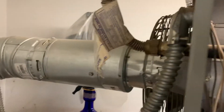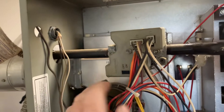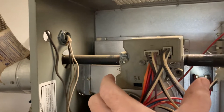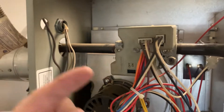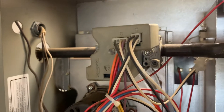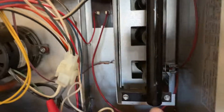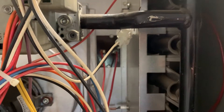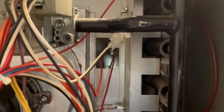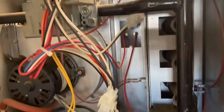The first thing you have is the gas coming in. You'll have a gas line with a shutoff valve coming into the unit, going through some black pipe and then into this gadget called the gas valve. This one is inside the unit — it may be outside as well — but wherever it is, it's in line with your gas because it's the valve that controls the metering of the gas. When the valve opens, it feeds the burners. There happen to be four burners on this unit. The gas flows out and is drawn into the tubes inside the ductwork, where air is forced over it and the hot air comes out.